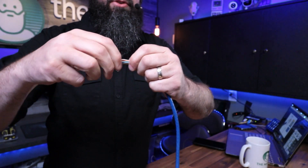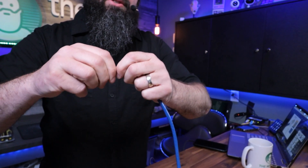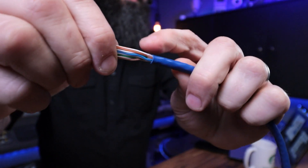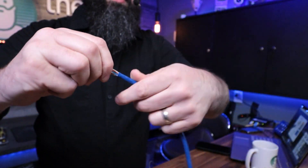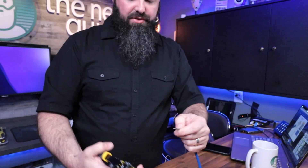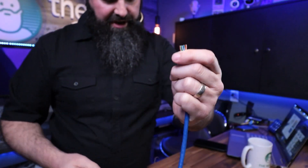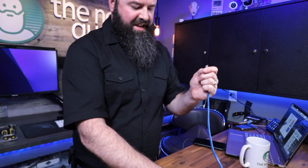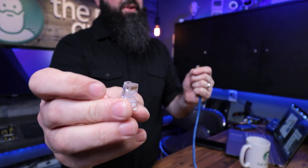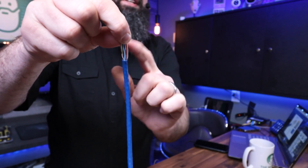I'm just lining them up and flexing them a little to make sure. I'm taking my sweet time here for you guys. To get the best shielding you want to make sure it's as tight as possible down on the end, so make sure you relax it all the way through. Now I'm going to cut those clean off. This is normally where you'd stop with cheaper ends that don't have the pass-through capability — you'd put this on and whatever stick-out is there is what you're left with.